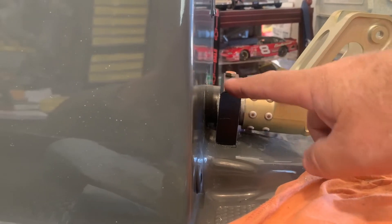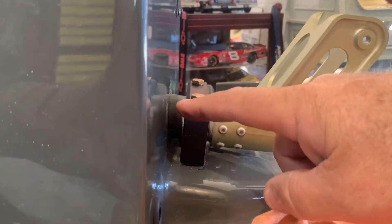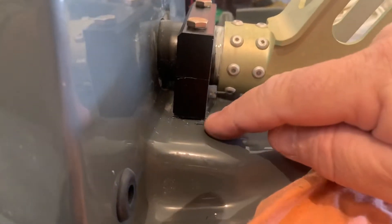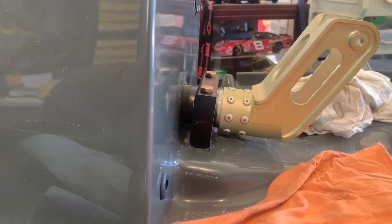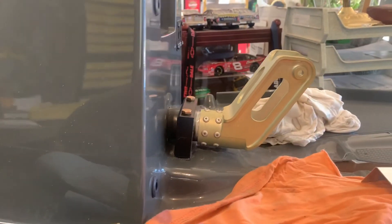Then when you go back over here, put it on your blocks, measure it, drill your holes, and you'll see that it's going to tilt forward. When it works best it'll be tilted forward and work smooth — until you torque the bolts. When you torque the bolts, it makes this bottom part go flat against the base, and that forces it back up and binds on the torque tube. This seat base is angled and the bottoms of these blocks are not cut to the right angle. So you can just sand the bottom, take a flat file and go across this corner to make it flat, or make a little shim for the backside — your choice.